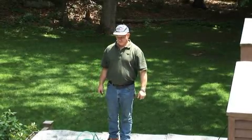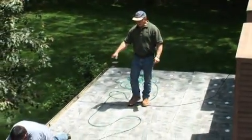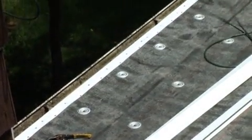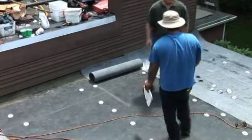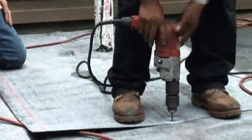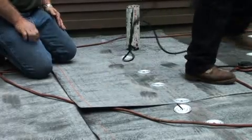Now we've repaired all the areas where it was a problem. We've tapered this roof to the edge of the gutter and installed a base paper. We passed the base paper and the tapered insulation, and now we're installing a drip edge. You can see the base paper almost completed — this was the old EPDM roof, the trampoline area. We fastened the whole tapered insulation down using six-inch screws to get through the tapered insulation to the plywood.